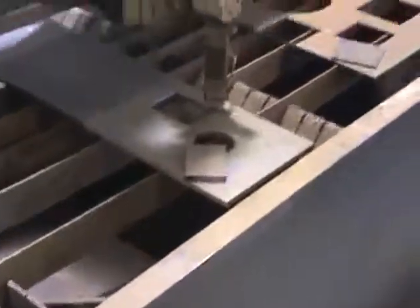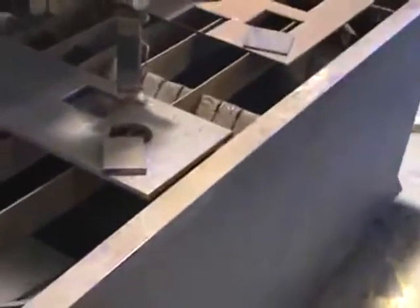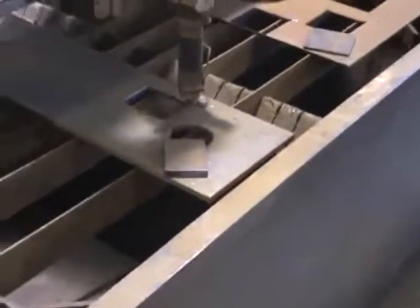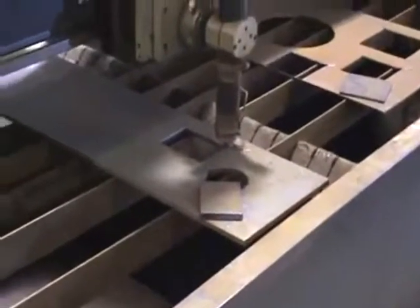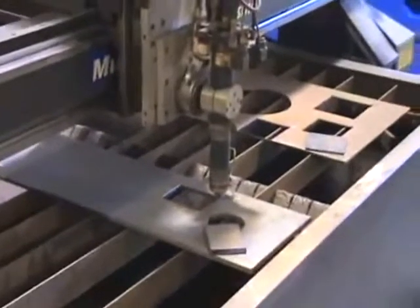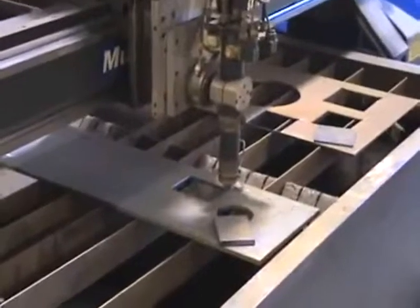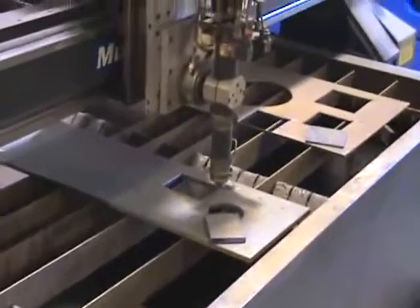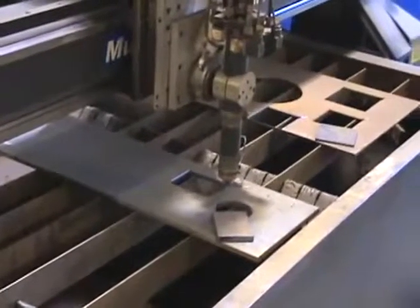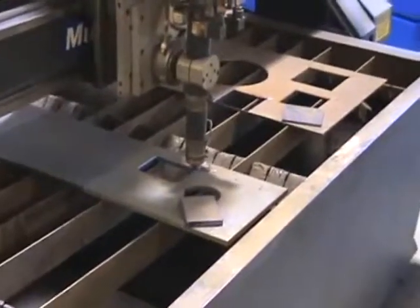Here is the bottom half of the part — very low dross, clean cut with the plasma. That's the half-inch part. Once again, this is a MultiCam 3000 plasma. There is a CamPro program that comes with this machine that allows you to nest and draw custom parts. It's networked off the laptop, and the laptop and program come with the machine to allow you to nest and set materials. For any more questions, feel free to notify us and we'll answer them as we can.